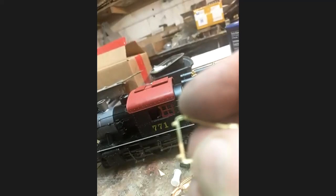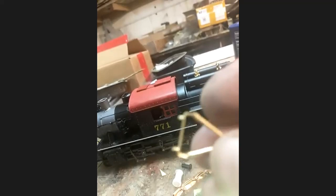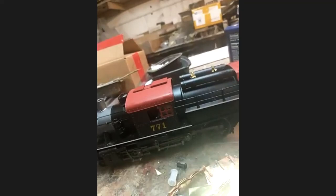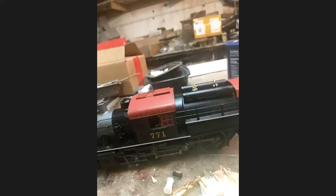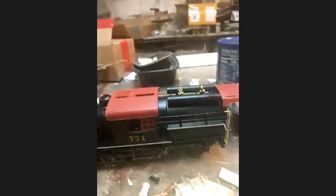And then the two little hinges are precision scale parts that came off another part, and I soldered them on. And then I put sprues on it, and I sent them off to either Precision Scale or to Dave Schock, a Valley Brass and Bronze Foundry, and he makes these things for me. These things, by the way, cost $250 a piece. These little parts here, for him to cast this, is $2.50. The little ones are $2 for him to cast these. He does very good work, and he works quickly. But that's how we do that.